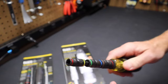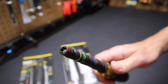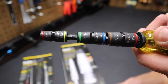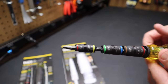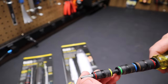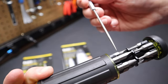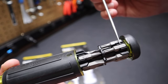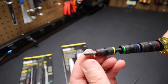Notice it holds a bit here at the end — a quarter-inch bit holder. If I pull this back, it clicks into another position — that's just for driving quarter-inch screws. You can see the magnet in there. Click this up and you can see it's laser-etched to indicate that in that position it's for driving quarter-hex bits, typically one inch in length. You can pull your bit out, go to the handle — here's a Phillips size number three — pop that in. All the bits are laser-etched; you can see that in the handle. There's T15 Torx, T20 Torx, 3/16 — they're all stamped and labeled.